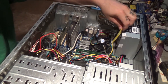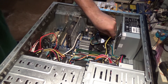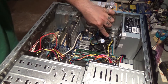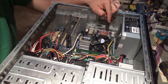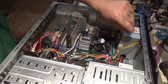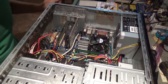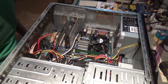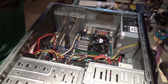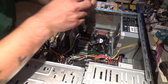If I plug the CPU power supply back in and press the power button, it goes down as soon as I plug the CPU power — there's a short and it shuts down. This indicates I have a short on my motherboard, probably one of the MOSFETs in the CPU power section is shorted.